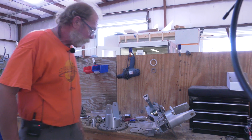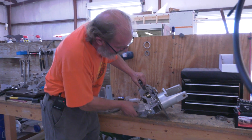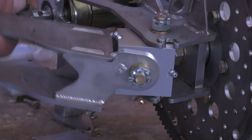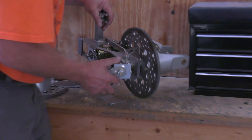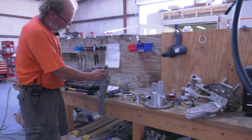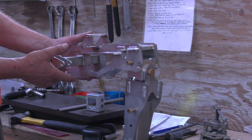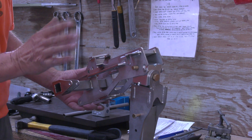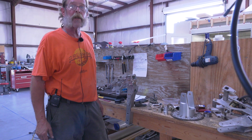Our castle nuts — there is a little friction, this is what is desired. Another check could be: by the time you have it tight and you lift the rotor head, it stays there — it does not fall down. This would be another way of setting the torque.